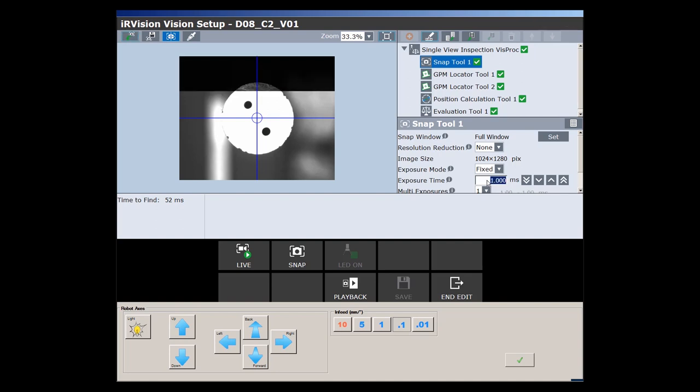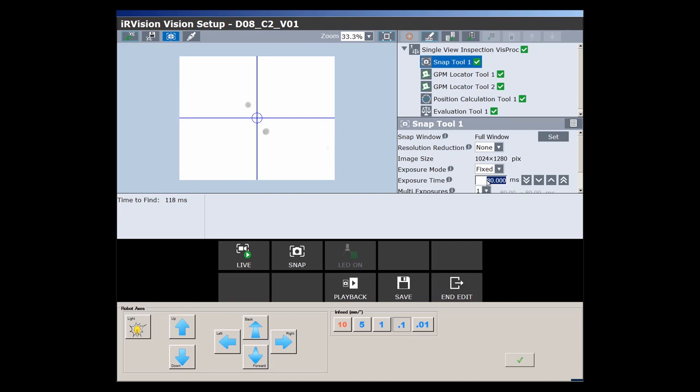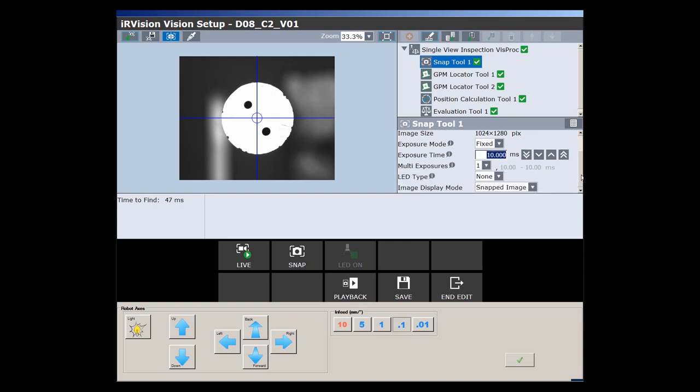First, I set the exposure time. The higher the value of the exposure time is, the brighter the workpiece is shown. Depending on the shape of the work face, the value can be different on different workpieces. It should be guaranteed that the areas which are used for positioning stand out as strongly and contrastingly as possible from the rest of the end face.